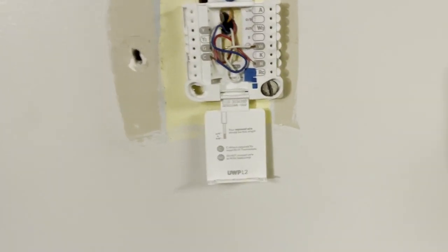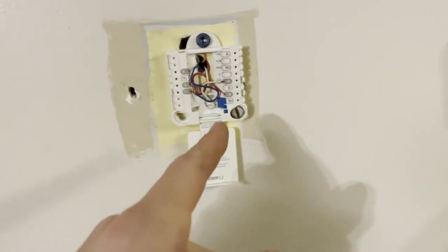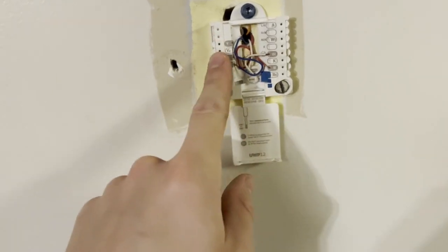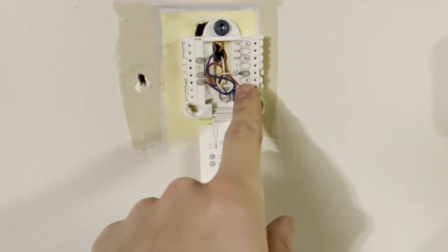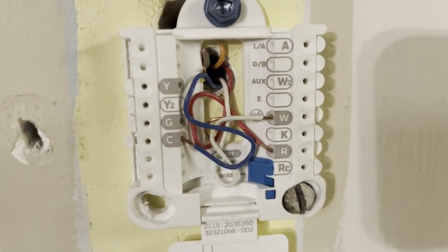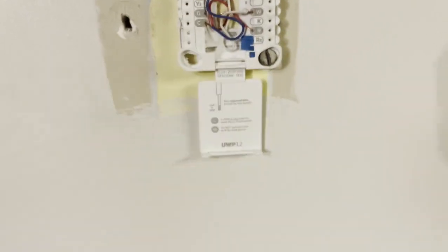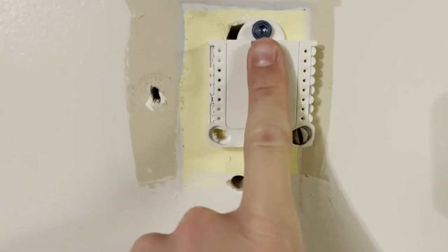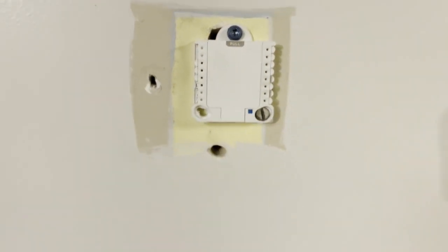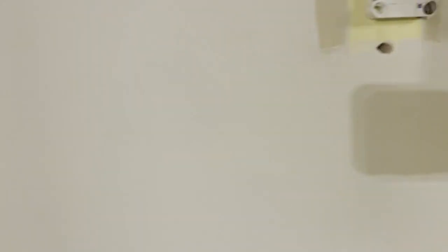That took some time — it's never easy. I had to drill the holes bigger to fit the new thermostat wire through. You will need a new thermostat wire because you're going to need the common wire. I got C, R, and W connected — C is blue — and everything is connected there. I have a concrete wall here so getting it hung up was a chore, but I found a way to do it.